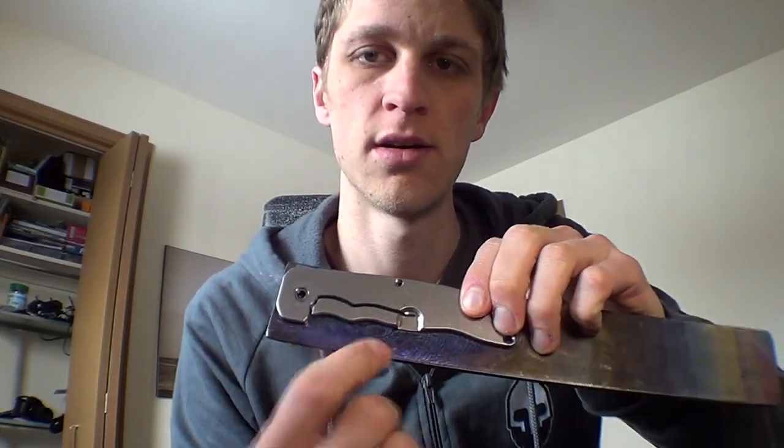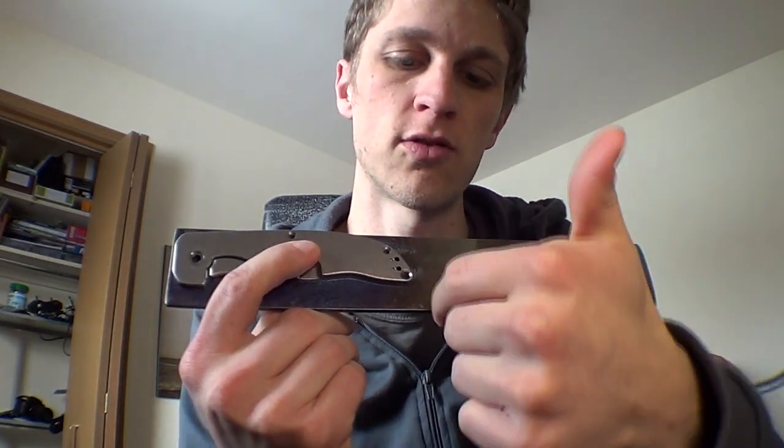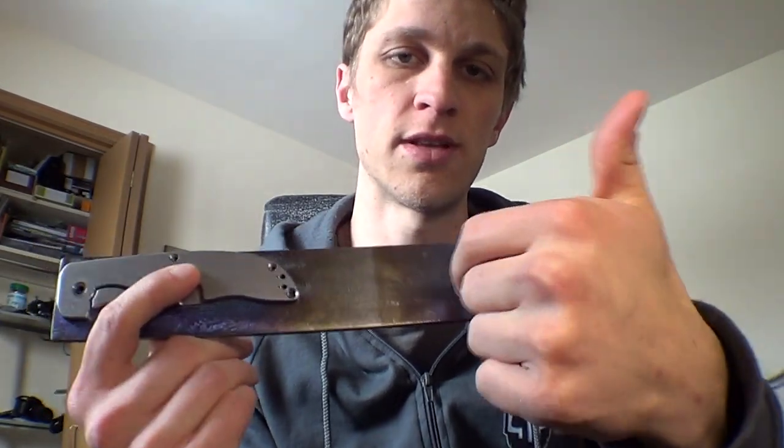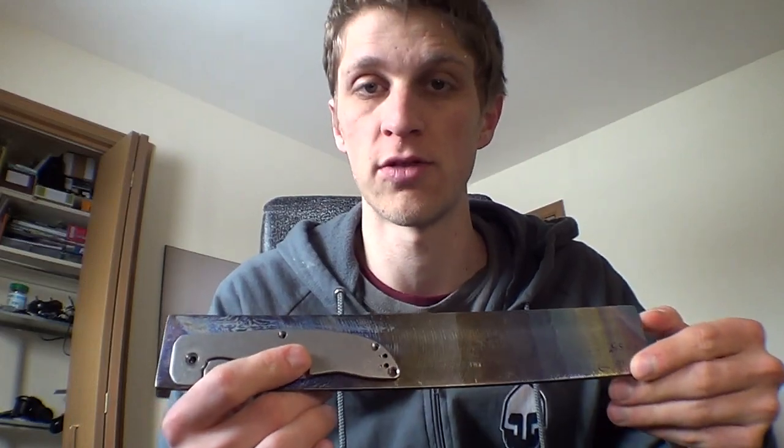With this piece I'll be able to get two handles — a pair of handles — but then I also want to snake a pocket clip in here, and another pocket clip on the other side, and then I can machine thumb studs in all the extra voids. The tricky part is coding where to put the thumb studs, the CNC code required to make that, and the pocket clips at weird angles. Everything's a really tight fit, so I'm using much smaller end mills than I usually do. I already spent the majority of my free time yesterday writing the code in SolidWorks for this.